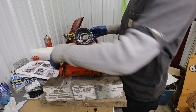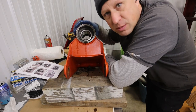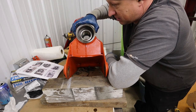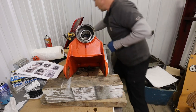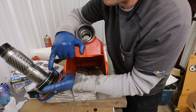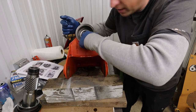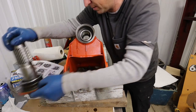Okay, let's turn this guy around here so we can fully understand what's going on. So this here is the bore of the piston. And what we're calling the piston is that center section that has the helical gearing on the outside, which interfaces with the case, and the reverse helical gearing that interfaces on the inside of the piston with the shaft. And we just talked about how this is the piston mating surface for the inside diameter of our cylindrical donut piston. Here is our O-ring that seals between the piston and this part of the shaft.